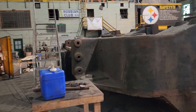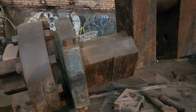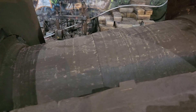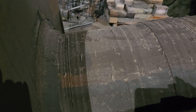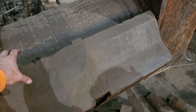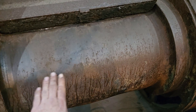Let's take a closer look at the engine, starting with the crankshaft. The first thing you notice is this should be a perfectly cylindrical bearing surface, but look at this — at the end of its life this thing lost lubrication and something happened to dig deep grooves into it to the point where the babbitt melted and fused itself. We can't get this bearing off; we're going to have to heat it up and melt the babbitt out to get the bearing off. Same thing with this one over here — not nearly as bad, but you can see it's kind of wallowed out.